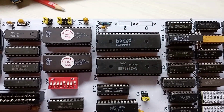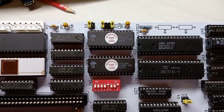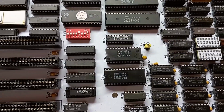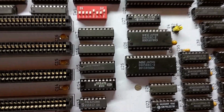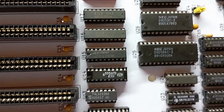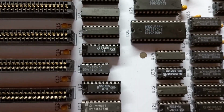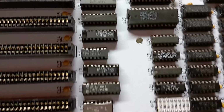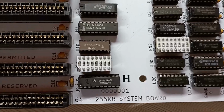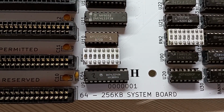Both ROMs are from Avito, borrowed from the original 5160. The BIOS and BASIC are original. Some chips, especially the 245, were taken from a 286 machine whose motherboard was beyond repair. The rest of the board is a mix of original 74LS chips, Chinese chips from AliExpress, and Soviet clones of the 74 series.